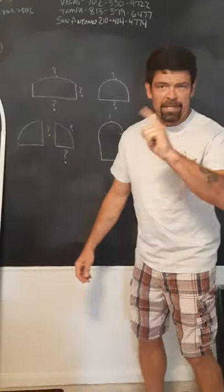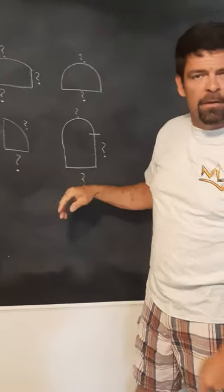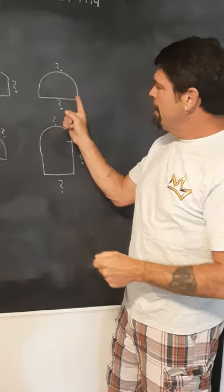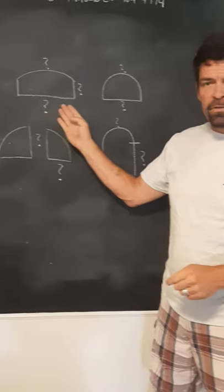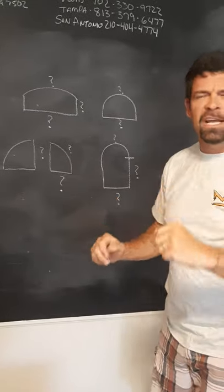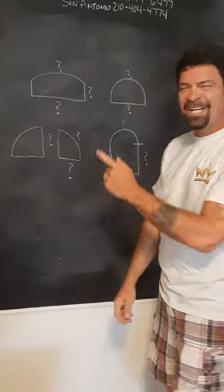How do we measure said arches? Let's start with the most common, the half moon. Always measure the dead width and then the center height. Because it's a perfect half circle, the machines we use — as well as companies like Quality Window Screens and Metro Screenworks — will always produce a perfect circle, so you only need those two measurements. For this style of screen, you always need your width, your short leg height — and almost always the left and the right are identical, but check it just in case that particular window company guy decided to have a few too many lunch margaritas and made one taller — and then the exact center as well.